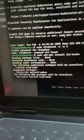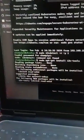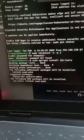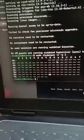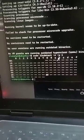I used the i2cdetect command, but it didn't detect anything because I didn't have the i2c-tools library installed. First I installed i2c-tools, then I ran the i2cdetect command and it successfully detected my MPU-6050.